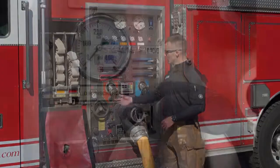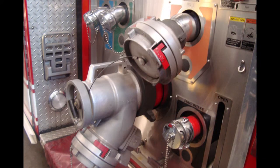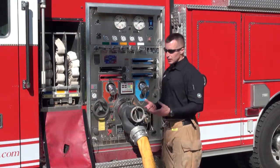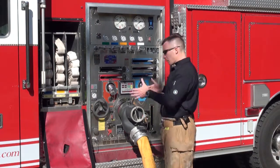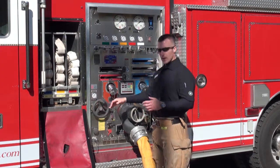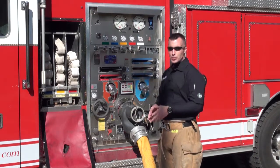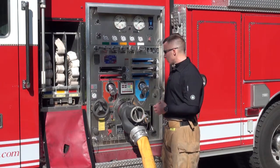Continuing down the side of the pump, over here we have the LDH discharge, which in most cases will be located on the opposite side of the pump. There's an NFPA change several years back that required the LDH discharge to be located opposite the pump operator for safety reasons. The issue with that is we can't always see it from the operating position. We can register pressure on that line and control that valve, but having the valve on one side and the actual discharge on the other can create connection issues. If somebody connects to the wrong discharge and you open that valve, it can present a potential discharge problem.